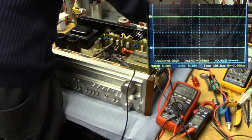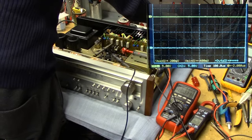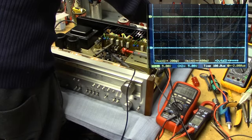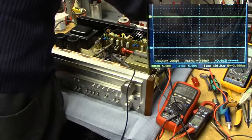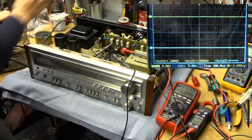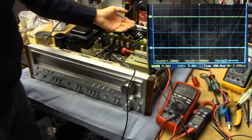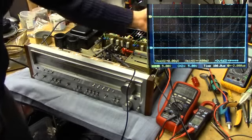getting there. We've got a relay click, and we're drawing 46 watts including the transformer, so I'm happy to take this up to 230 now. Okay, 230 volts, 55 watts consumed. Nothing's on fire.